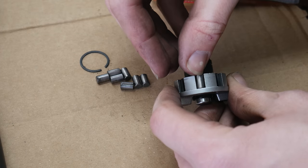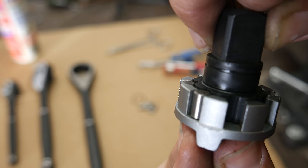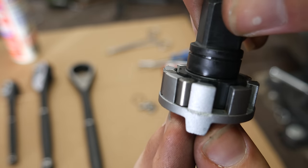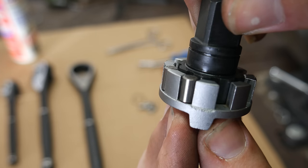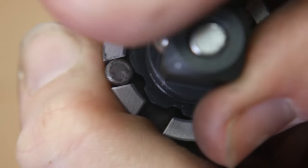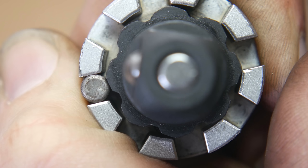With that back together, we can drop the rollers into place and hopefully get a good idea of exactly how this system works. The switch is actually in between the two detents and the rollers are fully retracted — you can see that they're sitting completely inside of that cage. But once we move the switch to lock the drive head into one of the detents, it pushes out on those rollers and extends them just a little bit beyond the outside of the cage. And that's how this mechanism works. Once the rollers are extended like that, they can roll freely in one direction, but it's very difficult for them to turn in the other direction since there is a wedging action forcing them between the drive head and the outer race. The more force that is applied to the handle of the ratchet while the drive head is resisting movement, the harder that roller is squeezed in between the wedge and the outer race. So the tighter a fastener is, the harder this mechanism locks up. It's a smart and very simple time-proven mechanism.